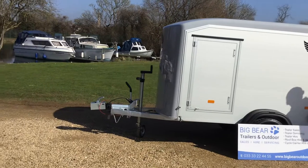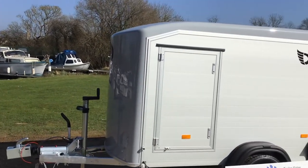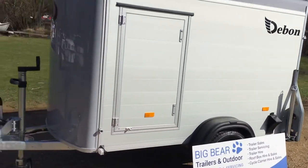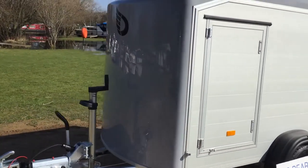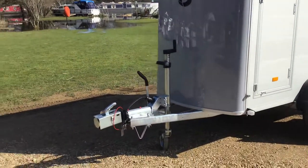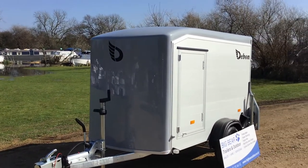This is the aluminium planking model, so it's a double skin with a cavity in the middle — I'll show you a sample of that in a minute. Just to give you an overview: the trailer's 1300 kilograms gross weight, meaning the trailer plus its load can't exceed that figure. Load carrying capacity gives you about 850 kilograms.